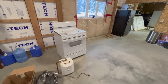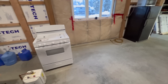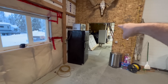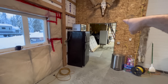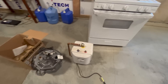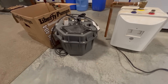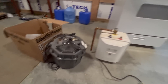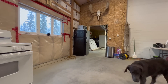Since this is going to be a temporary kitchen, we have zero plumbing in here — no water lines, no drain. So what I'm doing is pulling one cold water line from right over there behind the washer. When I get under the sink, I'm going to split it — go to this little hot water heater. And then for the drain, we are going to this pump here. The sink is going to drain into that, and it's going to pump right back over there behind the freezer, same place the washer is going.